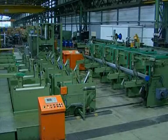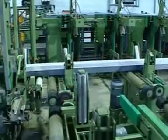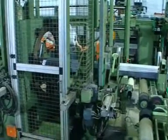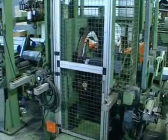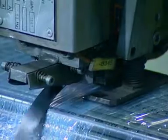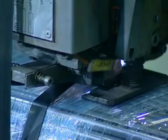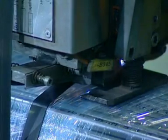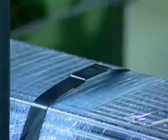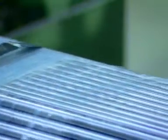Careful treatment of the packaging goods has been the main aspect during the conception of this strapping system for high-tech tubes. Due to the precisely controlled patented TIG weld joint, the plastic protection film stays completely intact. The speciality of VS-12L strapping heads are minimum sealing surfaces, which guarantee a secure strapping even for small hexagonal tube bundles.